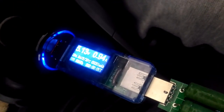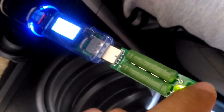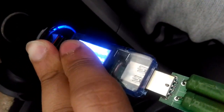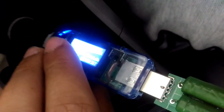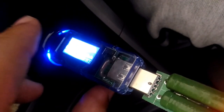So I am now at one amp of load at 5.14 volts, and I'm switching to two amps right here. It's now on two amps and it is still keeping up — it's working pretty fine. The noise seems to be increasing when I connect the load. Let me turn off the fan completely so this is the background noise at the moment.